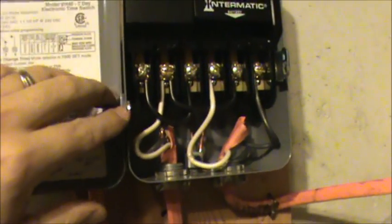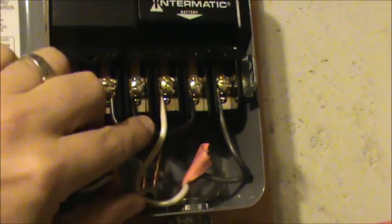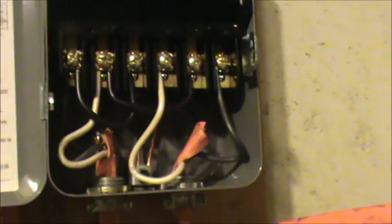Here's the timer all hooked up. Opening the door, inside you can see the wiring — I've removed the plastic cover for clarity. Our wire from the panel: line one goes to lug one, then a jumper from lug one goes to lug three. Our other hot wire goes to line two, with a jumper going to lug five. Our two load wires: one goes to lug four out to the hot water heater, and one goes to lug six out to the hot water heater. Both grounds are locked into the ground terminal in the back.